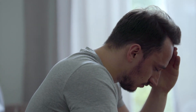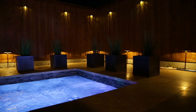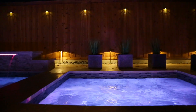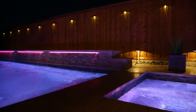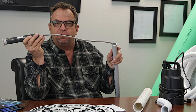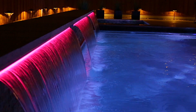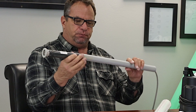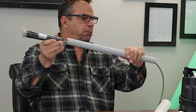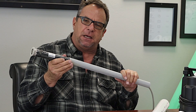This is a Hayward light — the Omni Logic Control Color Logic light. It's a beautiful setup. These little LEDs fix into the wall of the pool, so your light will be shining out there at low voltage. Great lights. You could lay this cord down in the gravel and cover it up, but this light is warrantied for three years and it can and will go out, so we want to prepare you for replacing that light. I've got some conduit here — it's one inch — and I'm pulling it through. It's got a little tug to it.